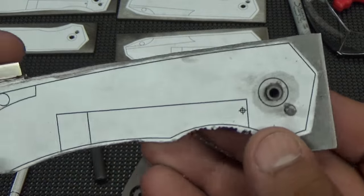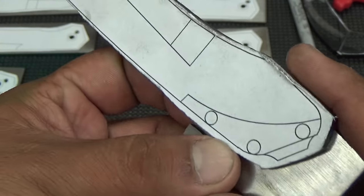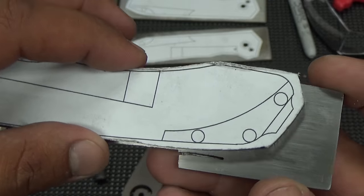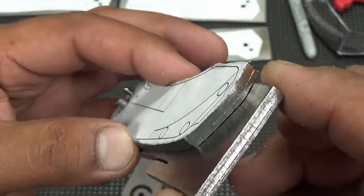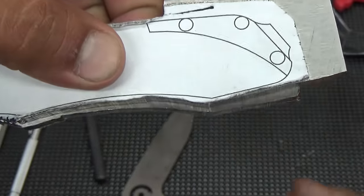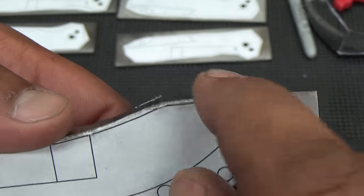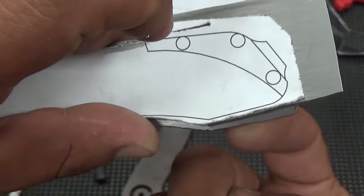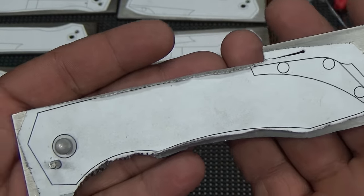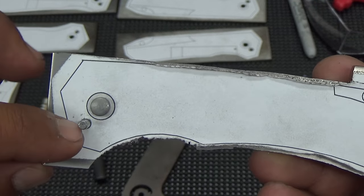So now it's held together with a stop pin and a pivot, and as I said before, there's a little bit of wiggle. That's kind of normal — those two locations are so close together and they're not interference fit, not press fit in. Even then you might get a little wiggle. A little wiggle's okay, so we're going to kind of go to the center of that wiggle. But if I hold it there, look where we line up. Watch this bottom piece — see where it is? Flip it over and we're not lining up. I would have to alter the design of this handle in order to get it to line up. It's just because of the way we only worked on one axis of the stop pin.